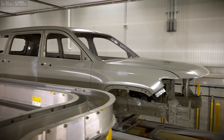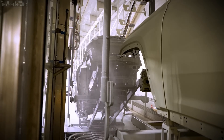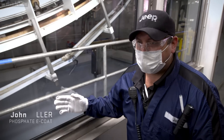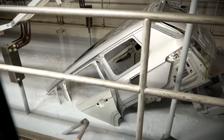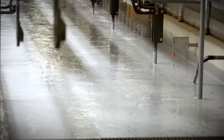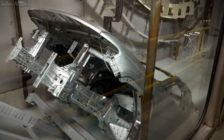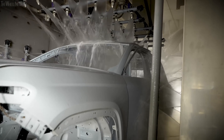The paint shop process primarily starts from body in white — the car is in white metal. It goes through phosphate E-coat, putting the first layer of corrosion protection on. We're at Electro-coat, E-coat Stage 1. This paint is electrochemically applied through 87 anodes in the tank charged by a DC rectifier, which charges the paint to the car. There's about a three to five minute dwell time through the system.